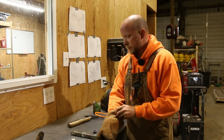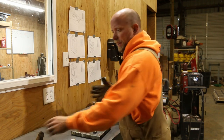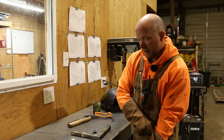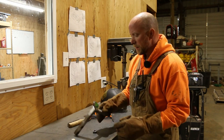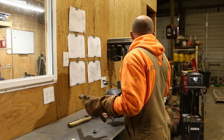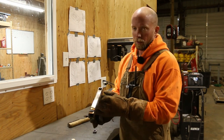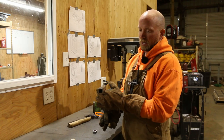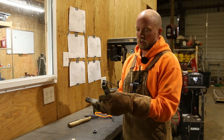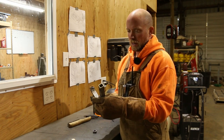Well, I've been welding for about an hour now, just playing. Made a phone call to one of the subscribers, and he had offered to give me some pointers. So we cranked up the heat. My current settings are 260 inches per minute at 24.7 volts, and I max out at 25. So I've got it cranked up pretty hot. When I put it up to 25, I actually burnt through the tube. So I was really hot there.